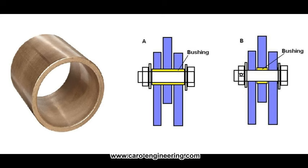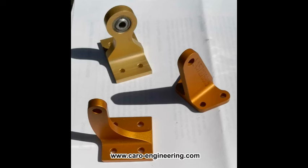If a loose fit is used, the bracket with the bushing can rotate on the bolt, or the bushing can rotate in the bracket. The bushing should be of a softer material like brass, bronze, or oilite, so that the friction is reduced even with inadequate lubrication, and there is no potential for locking up. Bushings can also be pressed in, but that makes them more difficult to replace when they are worn. A hinge with a bushing has the highest load capability, but friction increases with load. It is best used in flap and rudder systems where the friction is less of a factor.